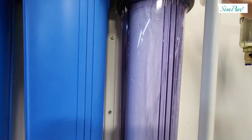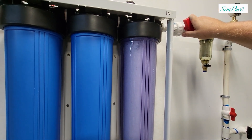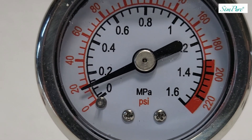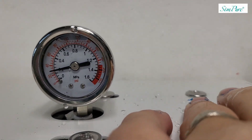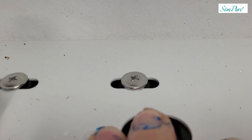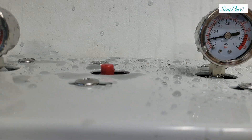For the water tightness test, bring up the pressure slowly to make sure you don't have a disaster — a small leak at this point can be easily corrected. Watch your gauges from right to left; they should be rising in accordance with each other. You also have to bleed the system using buttons on the top of each filter housing. In the last filter you'll see carbon deposit come out — that's very normal, and you'll see it throughout your system for about two days.